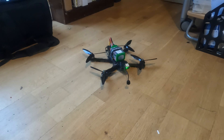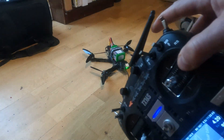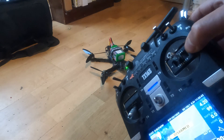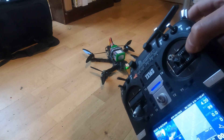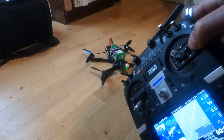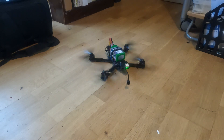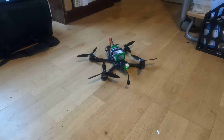So I'm going to try this in Stabilize. The first thing I've got to mention is I've put e-stop on channel 9 — that's function 31, so RC9 option set to 31, which is e-stop. That means when I arm and hit e-stop, the motors stop.